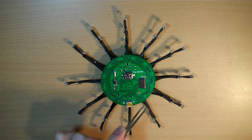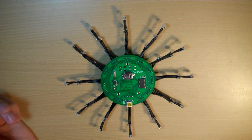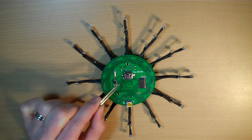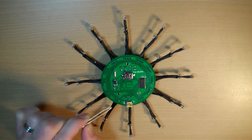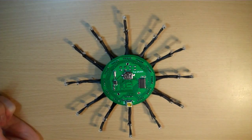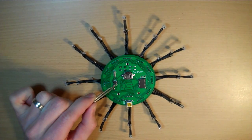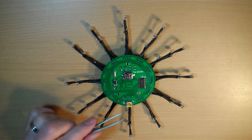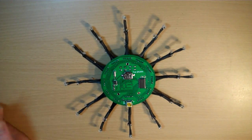I'm multiplexing four rings worth of color that way. We also have the RTC chip right here, which is keeping time. It's got this backup battery, a CR1220, and this clock crystal — 32.768 kilohertz. This communicates on the I2C bus with the ATtiny44. And then down here is the USB connector, which powers it. There's no data connectivity at all — it's only for power.